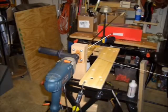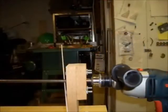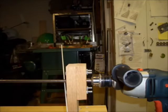This shows the overall setup as I'm getting ready to wind the 6-foot-long electric heater element. You can see the black 3/8-inch diameter steel rod coming out of the back of the jig, and the electric resistance wire coming in from the right. The thin white line you see in these photographs is actually a small diameter fiberglass rod that I have tucked behind the 3/8-inch diameter steel rod, so that when I get to the end of the steel rod, the fiberglass rod will flop over and let me know that I've reached the end and that I should stop the drill.